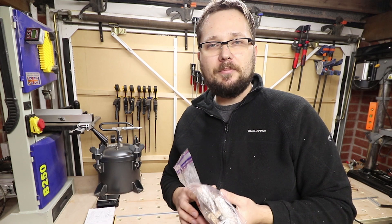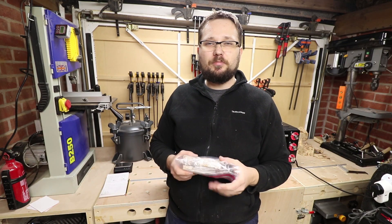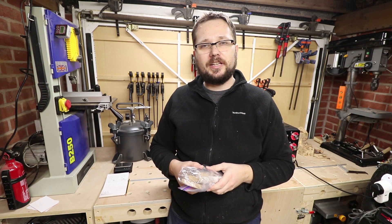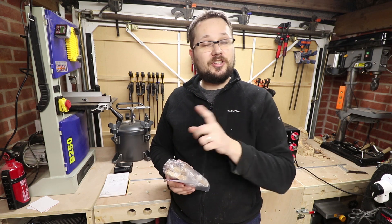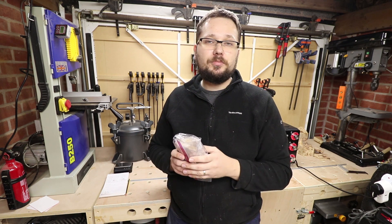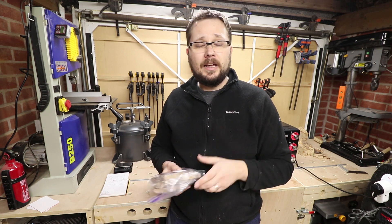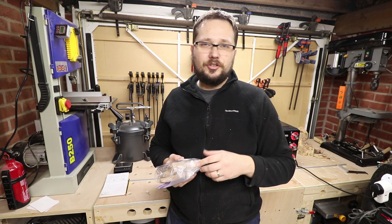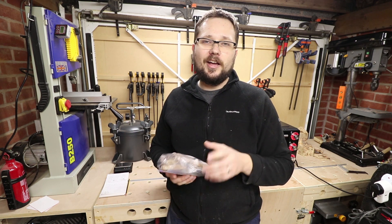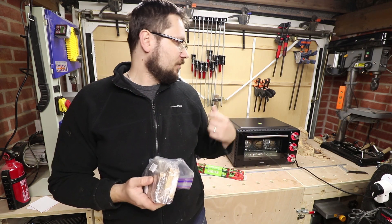This is the way I store my pieces after drying them in the oven, because spending so much time and effort drying them and then not securing them from moisture would just be wasting time and wasting electricity. It's a simple process really, but it just takes time. I wouldn't recommend using an oven that is in your house because some of the wood may actually smell — use a separate oven for it. And it's exactly the same thing when you're going to be using Cactus Juice to stabilize: do not use your home oven, buy yourself a decent separate oven like this one.